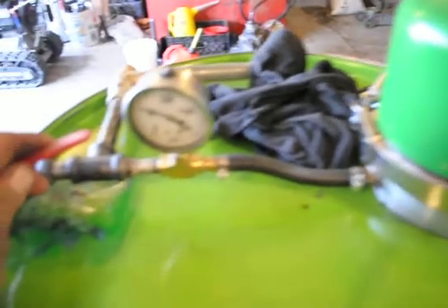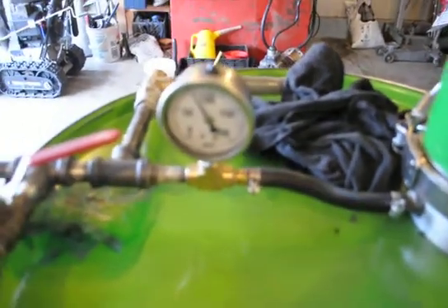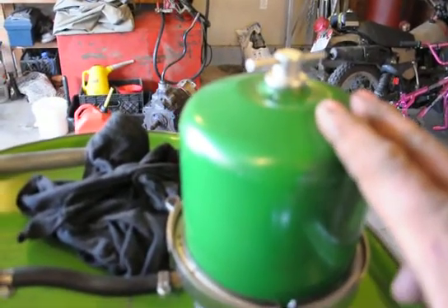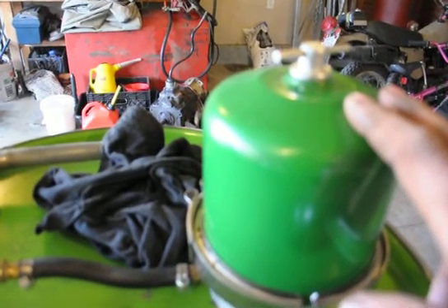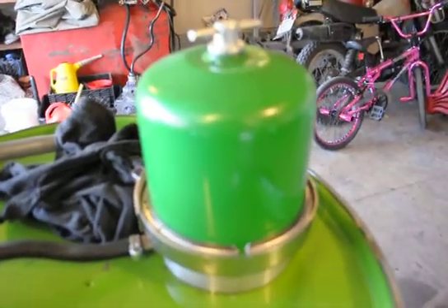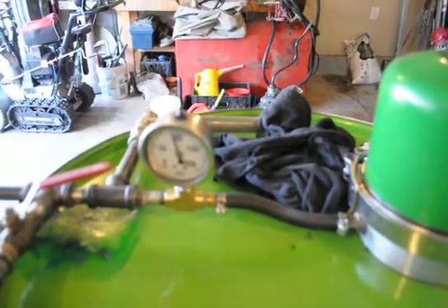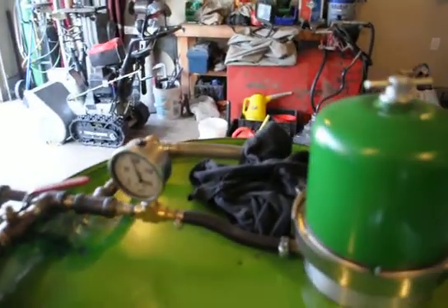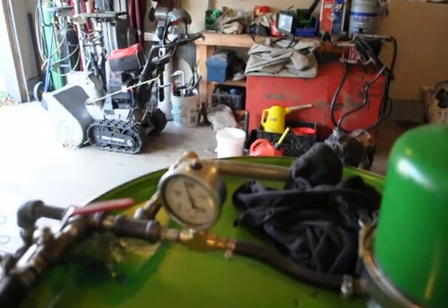As it goes, give it a little more. You can hear it changing tone, and if you can feel it you can see it vibrating — it's starting to spin. There it goes. As it picks up speed you'll hear the pitch change. Give it a little more. Let it run right there for a little while. The fluid's still a little thick, but we're basically just stirred up with used engine oil and about 10% regular unleaded gasoline.